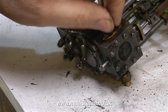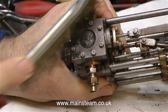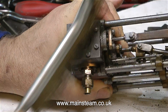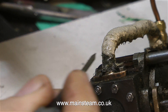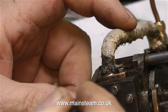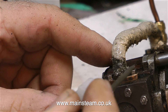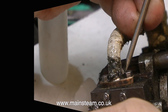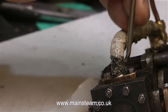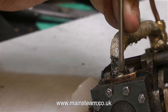As you can see, the pipe cladding has been damaged slightly by the vigorous action of the wire brush, but I'll fix this very shortly. In this clip I'm removing the last remnants of paint from the steam chest cover. Once all the wire brushing is out of the way, I can repair the pipe lagging. I'm using cyanoacrylate adhesive and a small screwdriver to guide it into place. For pipe lagging I normally use string — you have to wrap it around the pipe many, many times and seal it as you go with cyanoacrylate adhesive. The stuff on this engine I'm not sure about, but either way the cyanoacrylate adhesive will fully seal it.